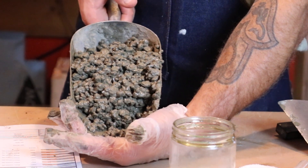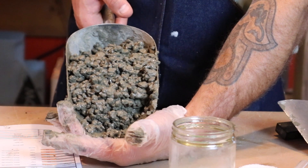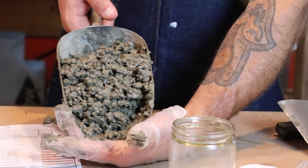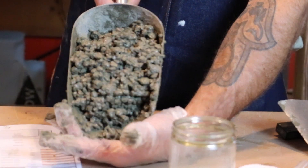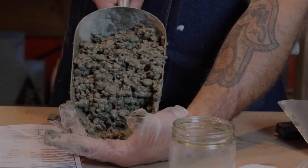For the next mix — we are going to do a second one — I'm going to take a little bit more of that powder out, that total cement, because I want a little less paste. But I still want that shininess. If you come to a point where you've lost that shininess — gone from shiny to a dull color — then either you need a little bit more high-range water reducer, a little more water, or a combination of the two.